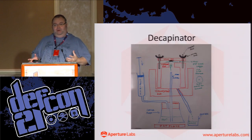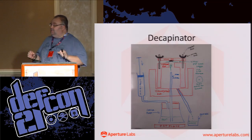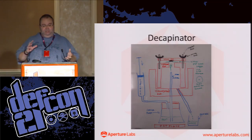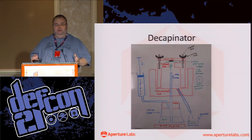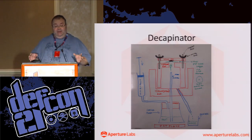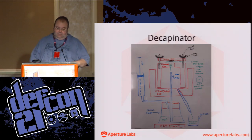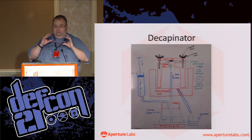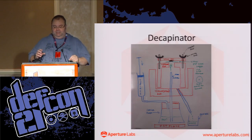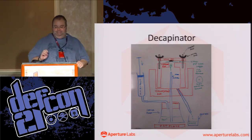And Teflon is resistant to hot nitric acid. So I got Teflon rod of 2 different sizes. And I wanted to try and use simple tools. So this can all be done with a drill press and just some simple woodworking bits. And the Teflon cuts like a dream if you use woodworking tools on it. So I chopped out these 2 cups, drilled a hole through the bottom.